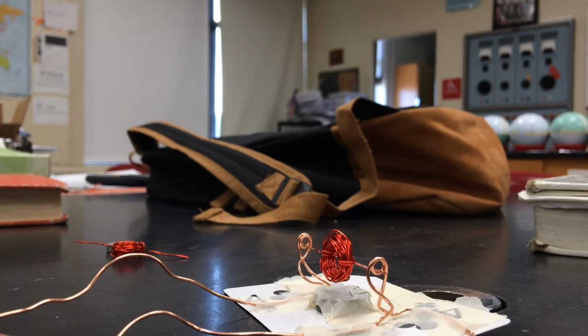It doesn't really lead to any sort of net motion. It's almost like the forces are opposing each other. They pull one way, then they pull the other, then back and forth, and nothing happens. And that's exactly what happens. That's why the first coil of wire we had was set up so that the coil turned itself off every half turn. Apparently that's really important to keep the thing moving. And let's try to figure out why.